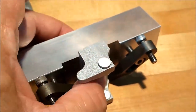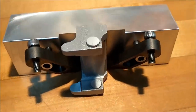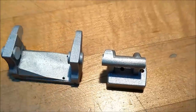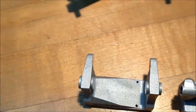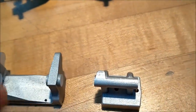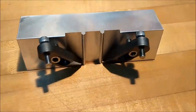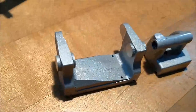and drill the holes. Now, the one thing you do have to keep in mind is if you're looking for a triangle that's going to line up, well, you better orient these pieces as such. When this sits in the machine, it sits in the machine this way. So if I'm going to indicate the part from this side, I better load the part and drill it from this side. Although every fiber of my existence is telling me to do it from that side, if there's any asymmetry, it's going to show up and just totally bone this part. So I don't want to do that. A couple minutes invested in the tool. Let's load these pieces back in the machine and get the end bores done.